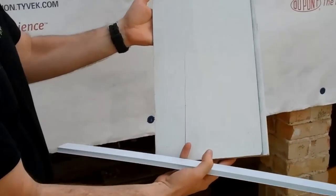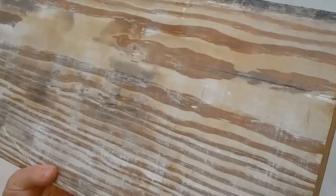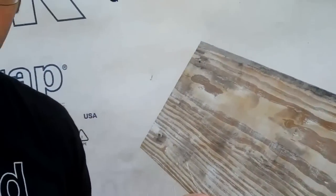This is the back of the siding. Here's the front face. We had to strip the old paint from the many years of painting that happened on this. But this is the original longleaf pine siding. And because this siding is no longer on a shiplap house with no insulation, we need to make sure that this siding can perform very well, even though we're changing the design of the walls behind the siding. In the past, if this siding leaked, there was no insulation in this old 1930s house.